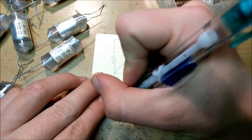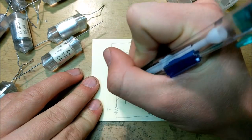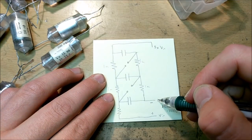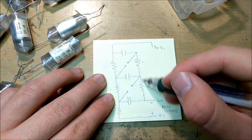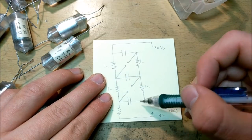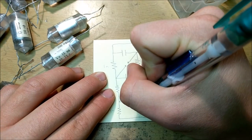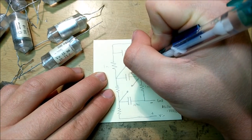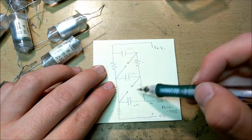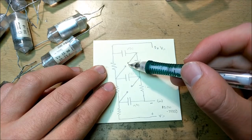So what that's going to do is charge all these capacitors through a series of resistors. Now each of these resistors is going to be rated at 1 megaohm, and what's going to happen is, because you have a voltage potential on this side through these resistors, and a voltage potential on this side through these resistors, it's going to charge all three of these capacitors to that same voltage. Let's just say 15,000 volts. Now what's going to happen is once all these capacitors have reached the breakdown voltage of this mini spark gap